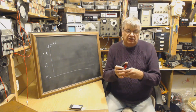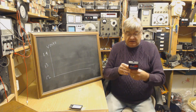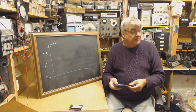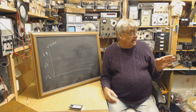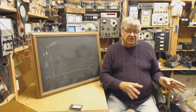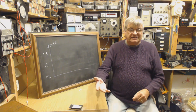This on/off type is probably okay for a lot of applications, but watching that, I had the analogue meter with the needle going back and forth — not doing the meter any good, to be honest. Whereas this one has a digital readout, which is good. It seems to just keep the level about right — it seems to know more what the battery is doing, rather than just: it's charged, turn off; no it's not, turn on.